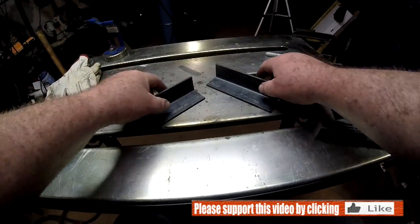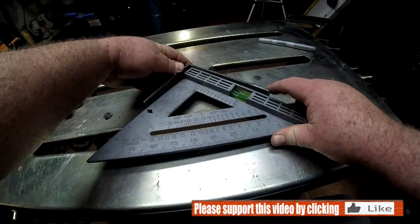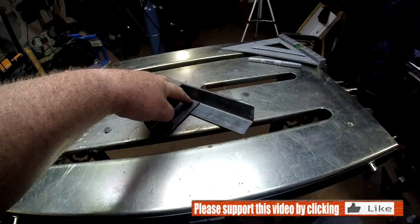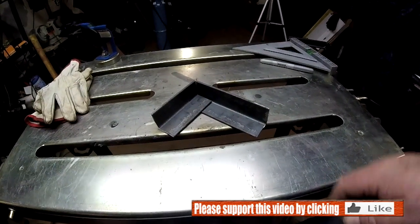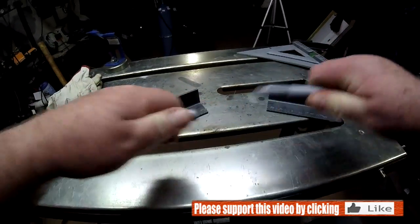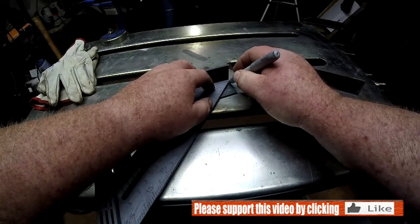The first joint we're going to talk about is basically a 90-degree corner. We always want to have our good friend the square with us because we want everything to be straight. In order to weld up that joint without overlap — which is going to make everything look crummy and extremely amateurish — we've got to do something. The first way we're going to talk about is mitering it. If we cut 45-degree miters on each of these bottom pieces...